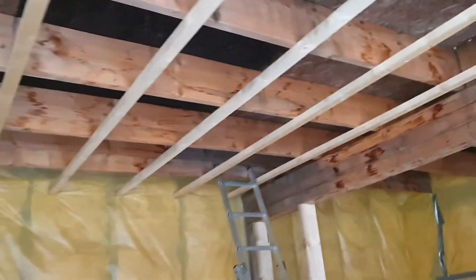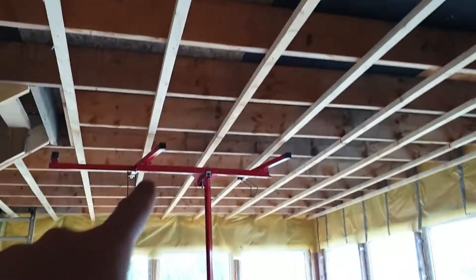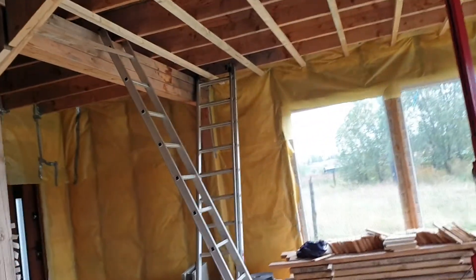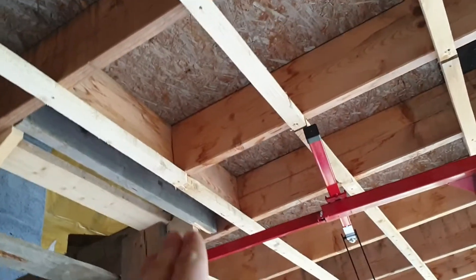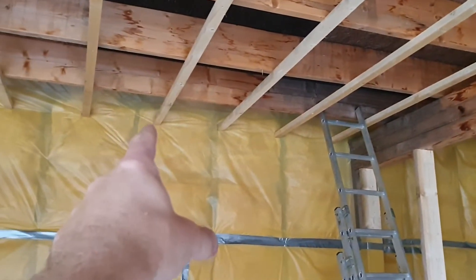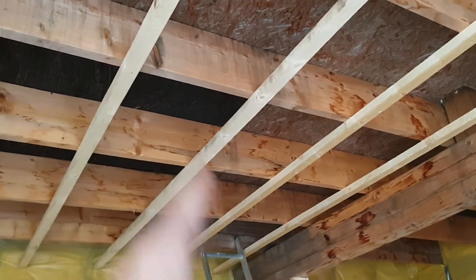A moment of work and it's done. It took me maybe two hours total — including cutting, carrying the boards, figuring out how to handle the cantilever, setting up ladders, and so on. With wooden battens that are fairly straight, three reference points are enough. I drew lines here, somewhere in the middle and at the end. I first screwed there, then screwed here. If the batten was warped somewhere, the middle line showed how much to shift it, then I filled in the remaining screws.